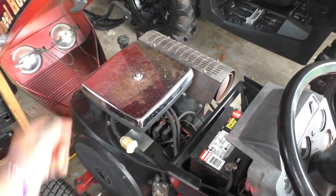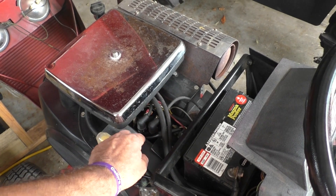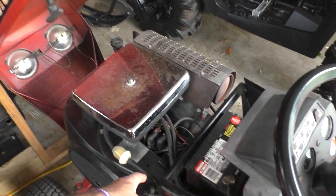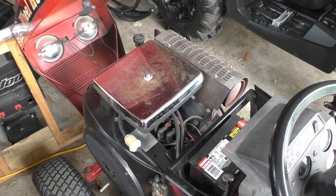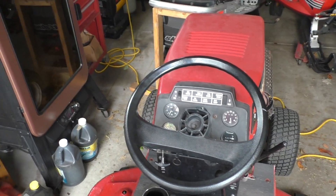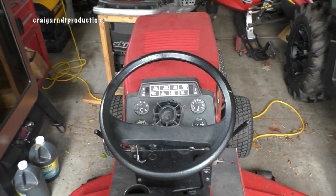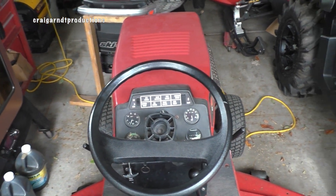I think that new coil is bad. I tested it — the primary windings came in at 3.7 ohms continuity, and the secondary windings came in at 23,700 ohms. They're supposed to be in the range of 14,000 to 19,000 ohms, and I'm getting a really high resistance. Everything ran great at first — wasn't misfiring — cut the front lawn and got about one row in the back, so ran for about half an hour. Then I started hearing a misfire; my tach was surging up and down. Maybe the heat got to it. So I ordered a used John Deere Denso coil made in Japan — was working when it came off the tractor — and I'm going to swap that out and send this piece of junk back to Amazon. Buyer beware.